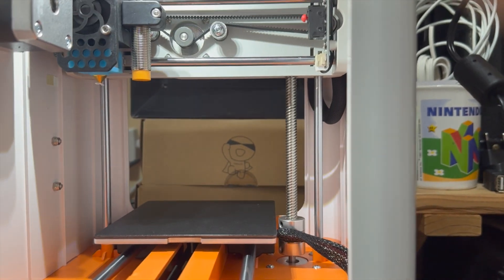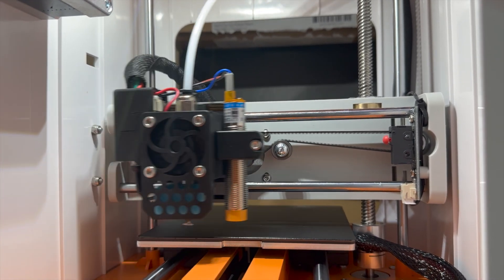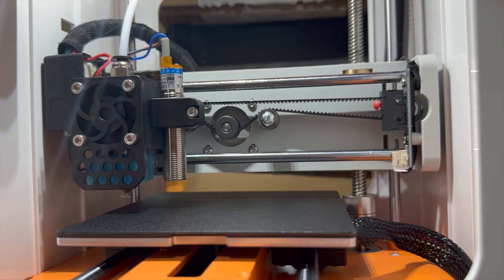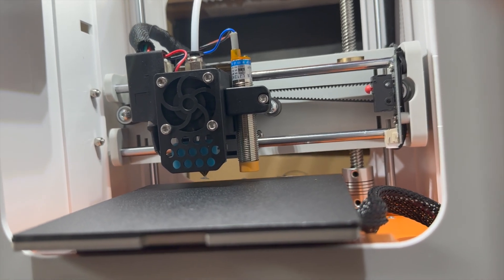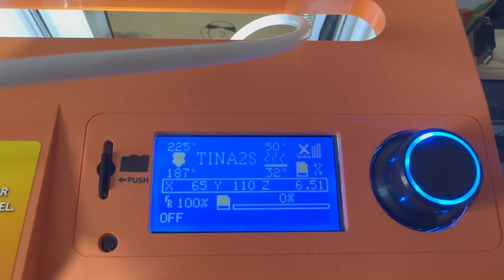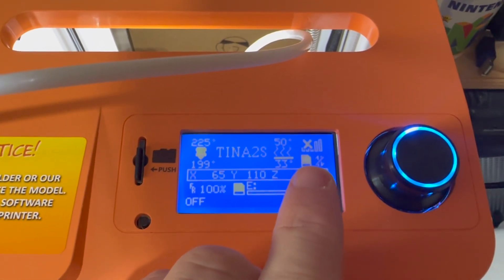I'm interested to see how it probes the surface. My old one used to light up at the top when it got close to the Z-axis — this one doesn't give a clue but it's probing around. Which is fine, as long as the proximity sensor is consistent in knowing how far above the bed it is, so it can position the extruder correctly.